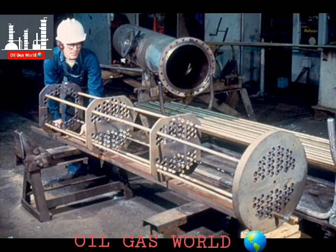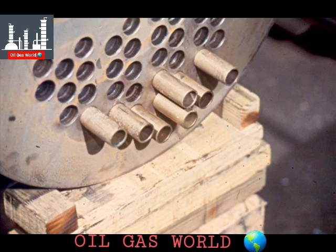After the framework is in place, using the tube guide, new tubes are inserted through the baffles and the stationary tube sheet. The first tube to be installed should be in the lower center of the bundle. Then work from that point in either direction, installing tubes alternately on either side of center.